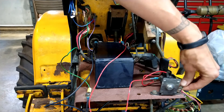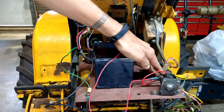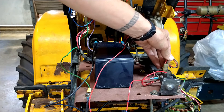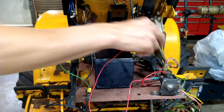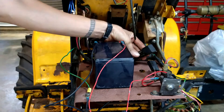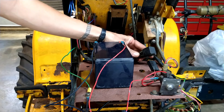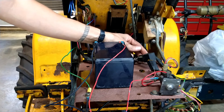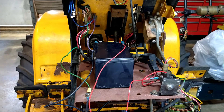You have an additional ground over here - this green wire. Back behind this you have the voltage sensor. This is what turns on the light on the dash that says amp - it tells you when the battery voltage is getting low. It says amps, but it's actually a voltage sensor. This is the PTO reverse relay. It's a safety mechanism to prevent you from running over things when you're in reverse with the deck turning - they had to implement it.